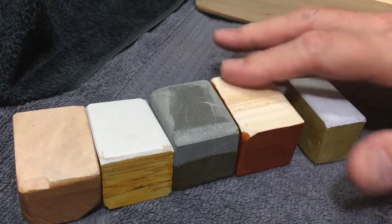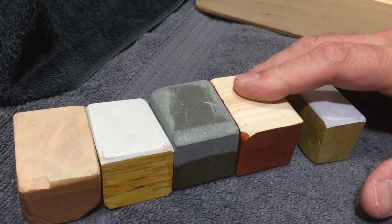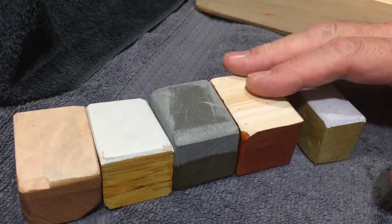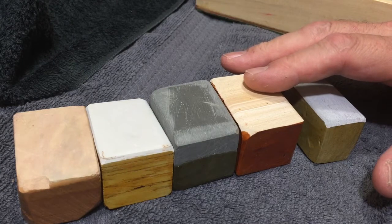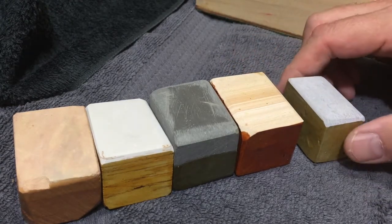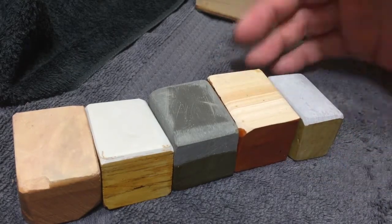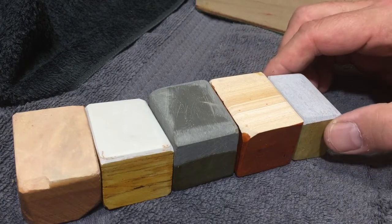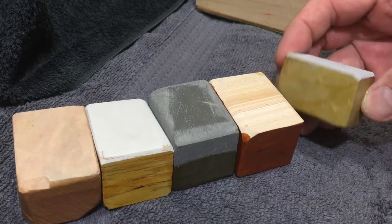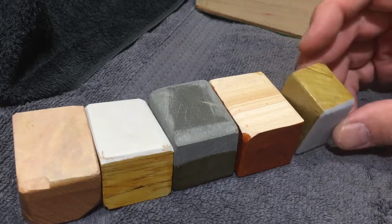This is very smooth cutting, mid-range. This quality stone would be used by a sword polisher in a larger piece, actually, to follow the earlier stages, and then would follow this with Koma. You know, I think Binsui is the stone before this. I can't remember off the top of my head. I'm tired. And here we have a lovely piece of Ujigumori, the real deal.